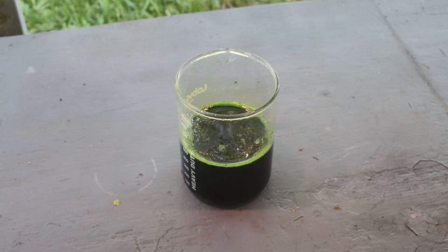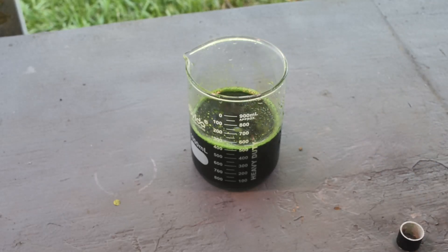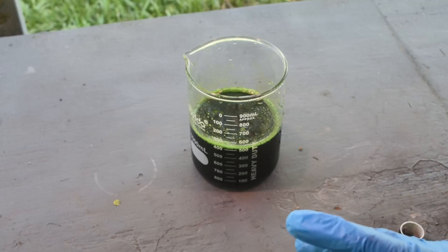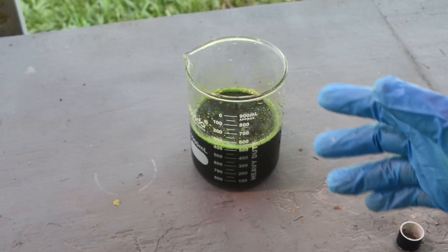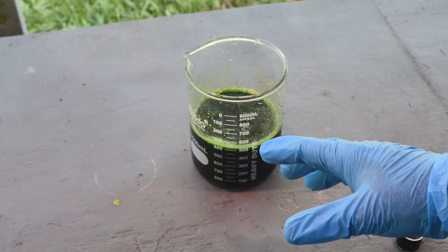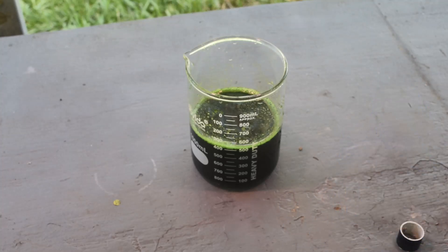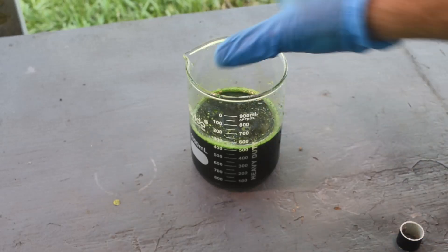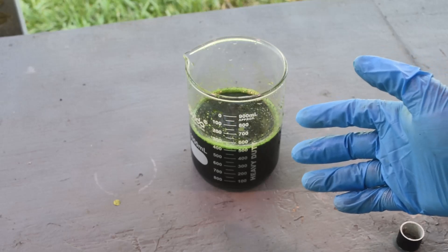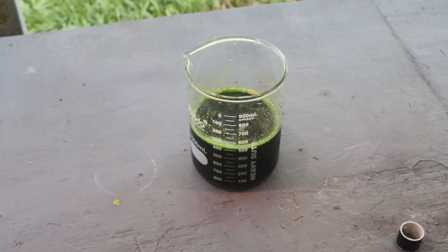It's a little quieter over here at the lab. We've got right about 500 milliliters of this deep green liquid. It's green because it's got a lot of copper dissolved in it. It started out as muriatic acid in a five-gallon bucket. I bubble air through with an air bubbler and submerge a plastic colander full of IC chips. Once it got saturated with metal salts, it wasn't working well anymore for de-legging. It took a couple of years — a lot of IC chips went through those buckets.